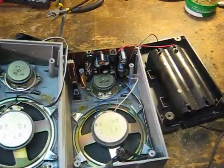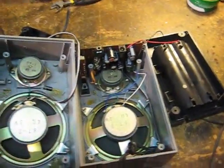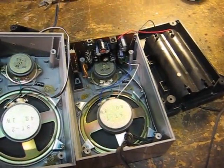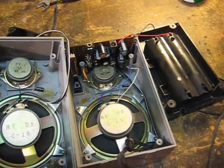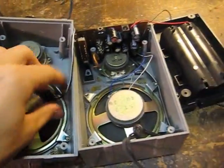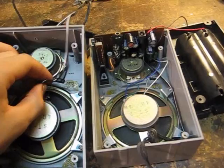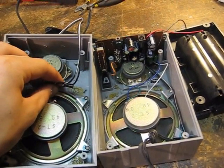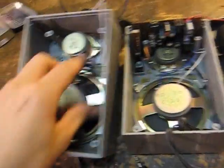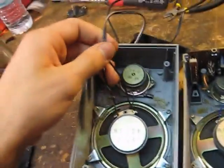This is what goes into your music player. Here are the two battery wires — I'm going to pull those out because I won't be using this huge case for these huge batteries. I'll be using a different power source. You don't have to use 6 volts like the speakers call for; you can do a little bit less or a little bit more. It's really not that critical. But the main part of this amplifier is figuring out where you're going to plug your headphones in — there's no headphone jacks, just speakers. But it's really not as hard as you think.